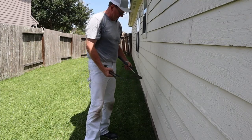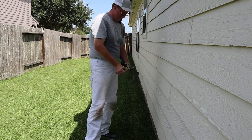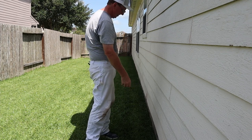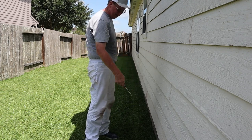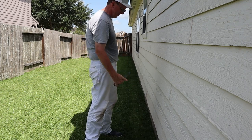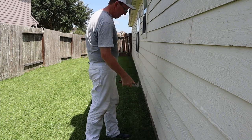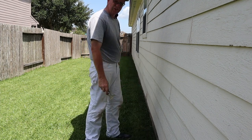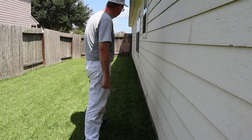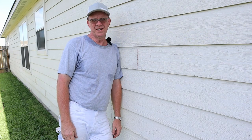I've got a multitude of tools here: a hammer, a couple of different pliers, a nail puller, and my 13-in-1 painter's tool. Because already where it's buckled, the nail's already popped loose. I just need to push this in, grab hold of the nail, and pull it out. If that doesn't work, I'll grab from behind and push it so it pops the caulking and I can get hold of it. I don't want to tear up the siding trying to get these out.